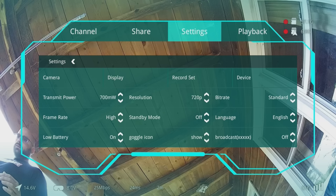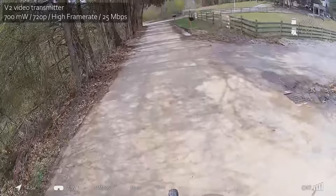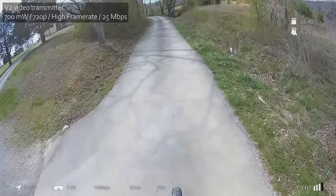Now here's the V2 video transmitter with only a single antenna, with exactly the same settings. This is also the Pro camera instead of the old standard Walksnail camera, but that shouldn't affect the video transmitter's performance, just the image quality. What I'd like to do is fast forward a little bit till we get to the interesting part — but something's already interesting. Why are we only at 14 megabits per second, even though we're dead in front of the goggles? They're pointed right here. That's weird. We're holding steady at 14 megabits per second.